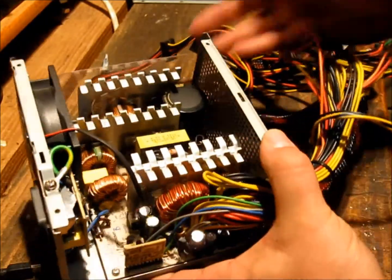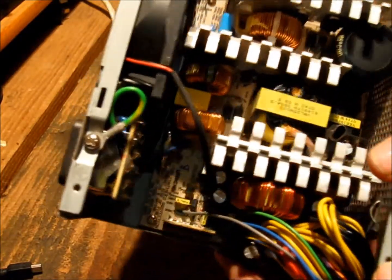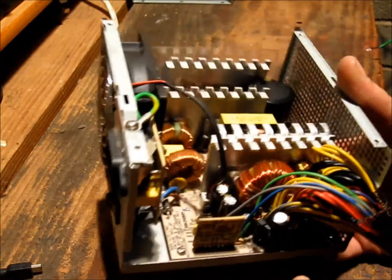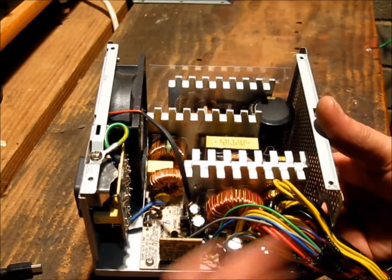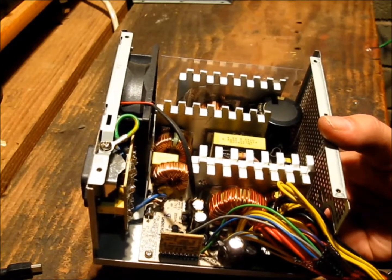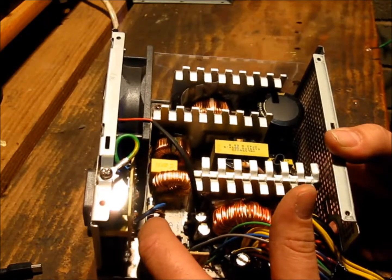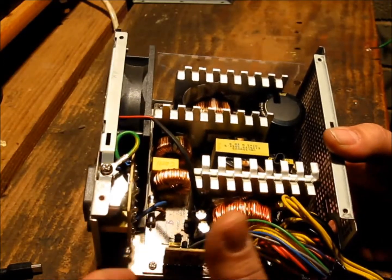Another thing I should mention — it nearly stuffed me right up. The fuse down here was actually blown. So when I reassembled for the first time and went to do a test, it wouldn't power up and I couldn't think what I'd done wrong. I went over my work again, checked all the soldering, and it was fine. The simplest thing — I didn't check it. When I did check it, it was open circuit. It was 8 amps, and the biggest I had on hand was 5, so I put a 5 amp in just to get me up and running, and I'll probably have to order something online.